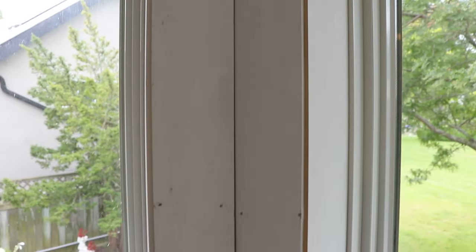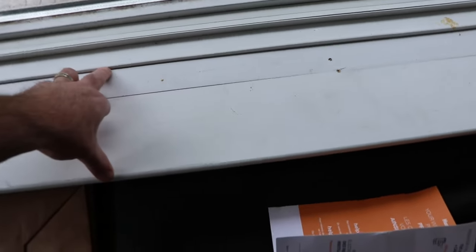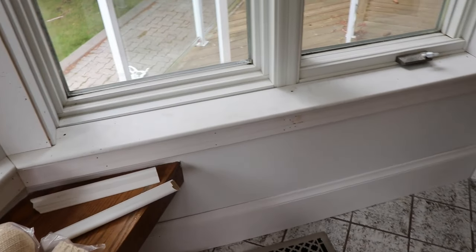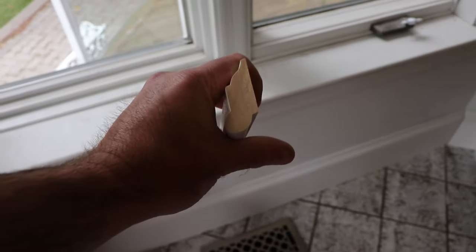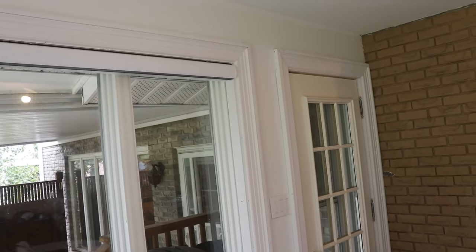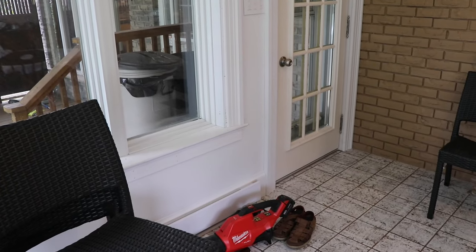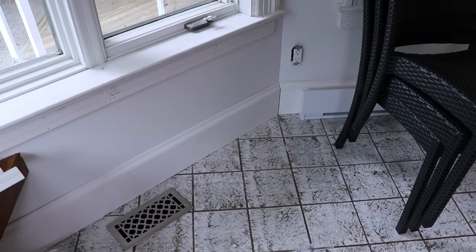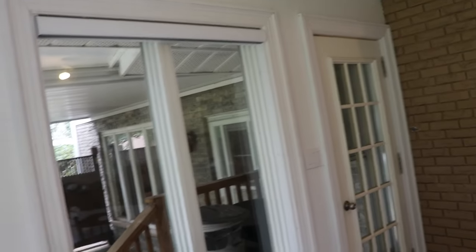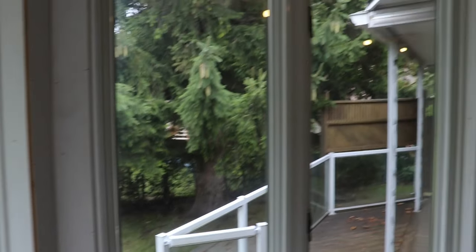Carpentry is never perfect, so the trim guy has to figure out solutions along the way. For the bullnose here, they didn't make a wide enough bullnose so I had to extend it, which is not ideal but it is what it is. I vastly underestimated the amount of picture hanger trim to purchase. What I had done was buy the same amount of picture hanger as baseboard, and that is not right — you have way more picture rail space than baseboard in a lot of cases. So I came up short a few sticks on that.